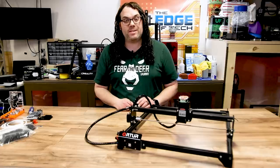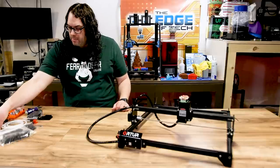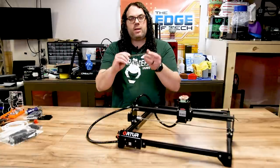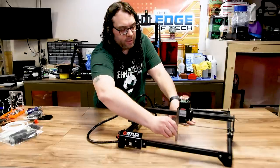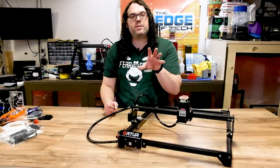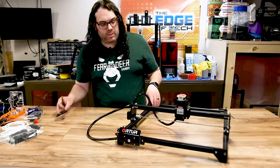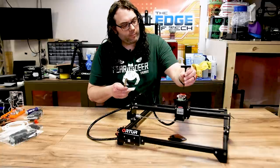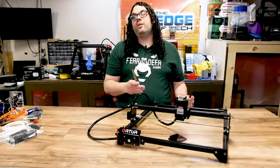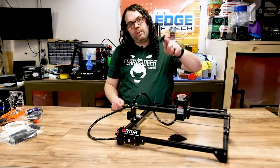That's it — we officially installed the Z adjuster master focusing kit! The awesome part is that if you know your exact focal distance — for instance, my G8 lens is right around 75 millimeters — you can grab a millimeter ruler, dial the laser down to 75 millimeters using the end of the housing, focus nicely, secure it, and then every time you're ready just drop material underneath, put the T-handle in, and turn to 75 millimeters. You shouldn't have to refocus every time, though it's always good to check.